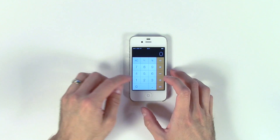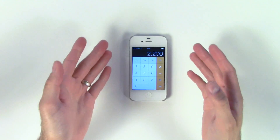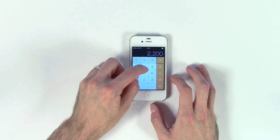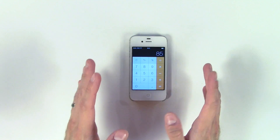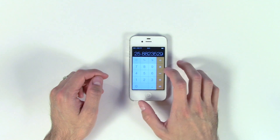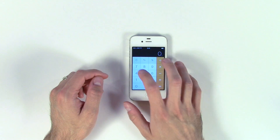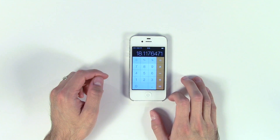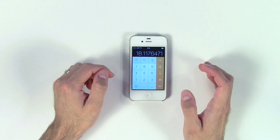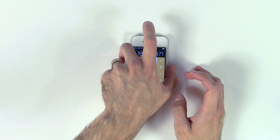I'm sitting at 81 to 82 milliamps, and I don't think I've seen it go above 83. We were sitting at about 85 milliamps current draw the entire time — and that's with the backlit screen. Let's do some quick calculation: 2200 divided by 85, rounded up a little, then multiplied by 0.7 gives us about 18.1 hours. That's very curious and makes me wonder what's going on there.